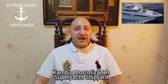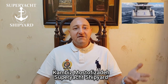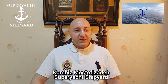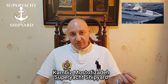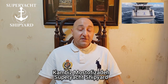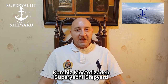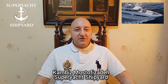If you're looking for a very lightweight motorboat that could travel very fast and it's probably going to be the size of a tender, then something like fiberglass would be perfect for that type of hull. But if you're talking about creating something like a cargo ship that's going to have a lot of wear and tear and is used 80% to 90% of the year, then a thick steel hull would serve its purpose much better. And if you're talking about something like a 250-foot super yacht, then an aluminum hull would do much better for that. You have to talk about the needs and the purpose of that vessel so the design can be tailored to meet the specific issues each of those purposes would come across.